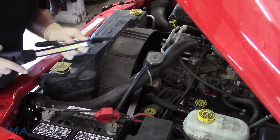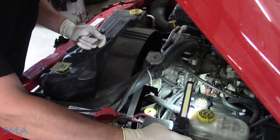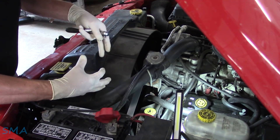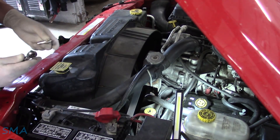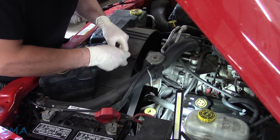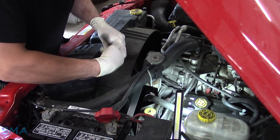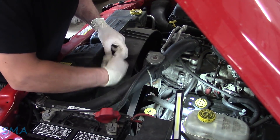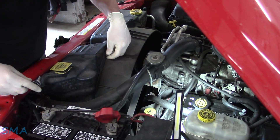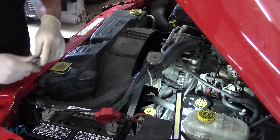Service data tells you to remove the belt, take the hoses off, pull the whole front bracket off, and then take the pump out that way. I'm just curious if we can just pull this fan shroud, leave the bracket, and just pull the pump off — do the pulley swap and everything while it sits in there. This fan shroud appears to be two-piece; like this upper half will come off, I think. That's what we're going to find out.